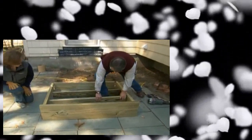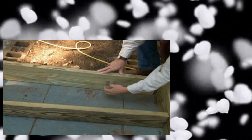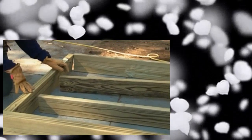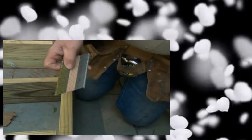Let me show you what I've done here. I've pre-cut all of the pressure treated wood for the landing. Under the door is a 2x8 pressure treated that will be a ledger to lag to the house. On the outside, on both sides, is a rim joist which will carry the 2x6 joist in the center for the decking to rest on. Out here I used a 2x12 — called a rim or header — because the stair stringers will mount to these. I'll nail these together using a special galvanized nail rated for pressure treated wood, then we'll use hangers.